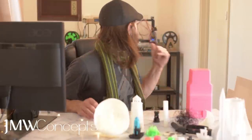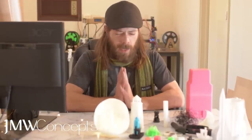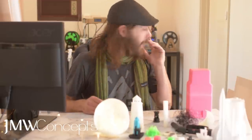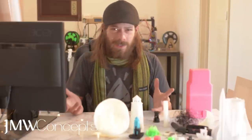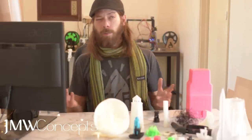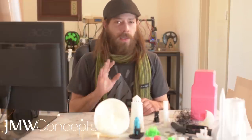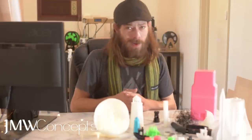I've got all fans and everything finished up on the printer. I've still got some cable management to finalize — if you guys have any great suggestions on that, let me know, it's the absolute bane of my life. The fans are on and working perfectly. I haven't had any overheating issues, no sign of connectors warming or the motherboard warming up at all, so that's a big plus. One thing I will say, however, is the motherboard fan does provide a little bit of what I call blow-off — just a little extra air that blows onto the print in certain parts and can cause issues. I'm going to print a little basic slip cover to sandwich between the two pieces of acrylic to block the side of the print bed.